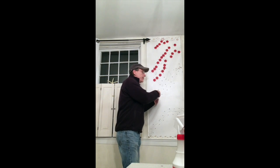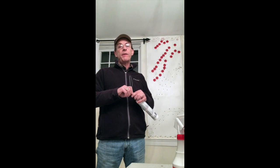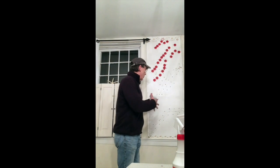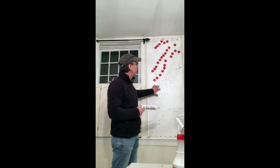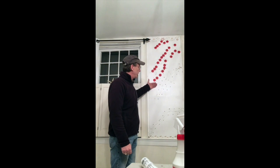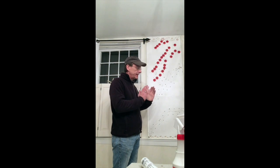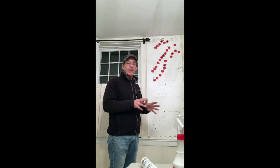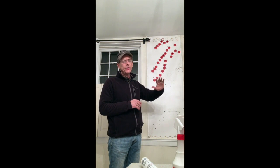One trick I found from the This Old House video: they said to put your tip in, measure it, and cut it — I don't suggest that. The stuff is very liquidy, not like heavy caulking. So I cut a very fine tip on the end. Then give it one good squeeze, release the caulking gun, shoot, release — because it will squirt out when it hits the lath. I highly recommend checking out Big Wally's website as well — he's got a great tutorial. The glue drips down between the laths, and when you screw on the clamps you'll actually see the glue ooze out the holes. Wipe it down with the wet sponge.